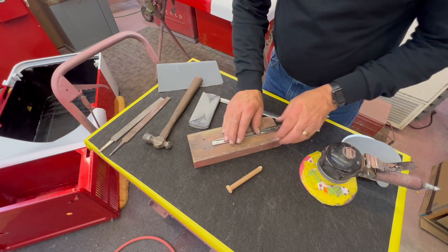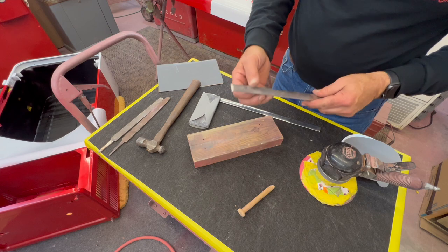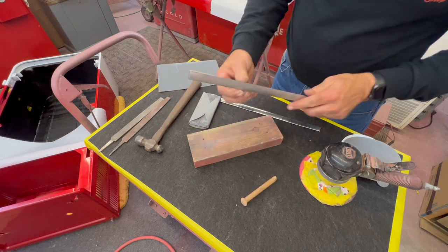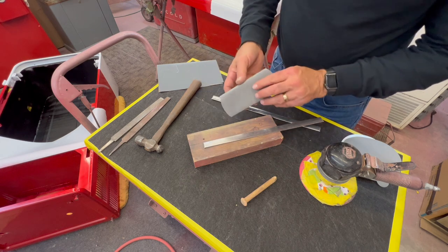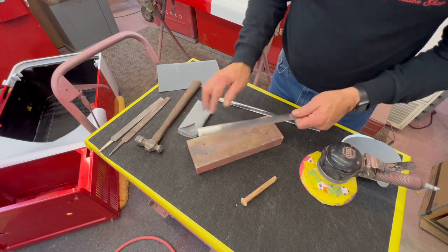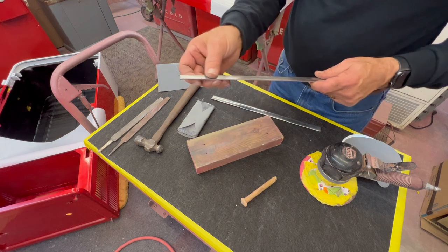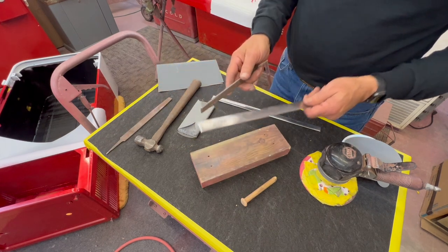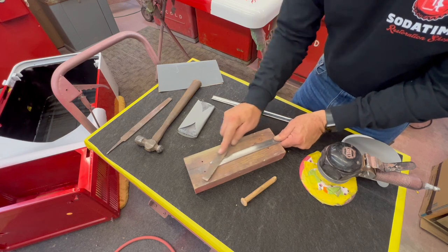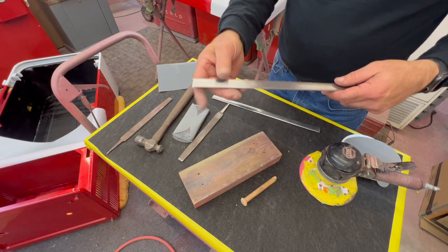I've talked about this in one of my earlier videos. How many of these — obviously some were worse than this — but I took them off. If they were beat up really bad, I threw them away. I wish I could get them all back today. I had a gentleman teach me how to do this process. And as you can see, no more low spots in there. If anything, I've got a little bit of a high spot. So your next step — use a fine file and go across these highs. As you're doing it, you'll notice the drag kind of goes away. And just like that, we're back to ready to polish.